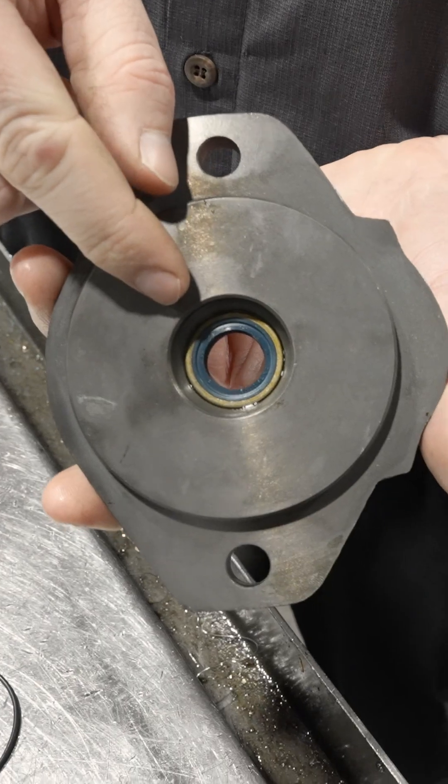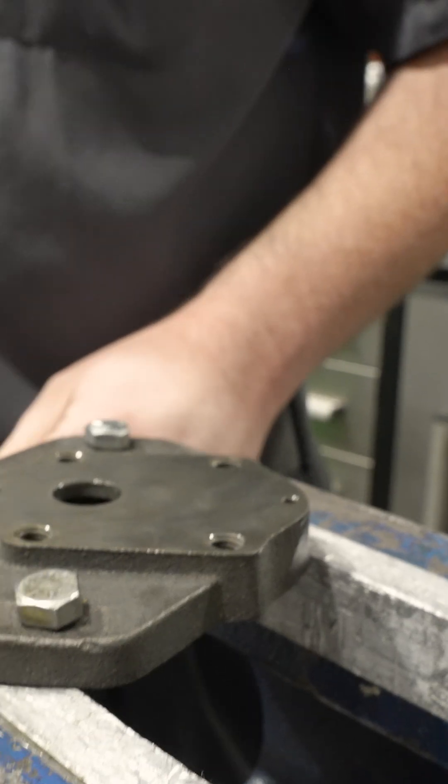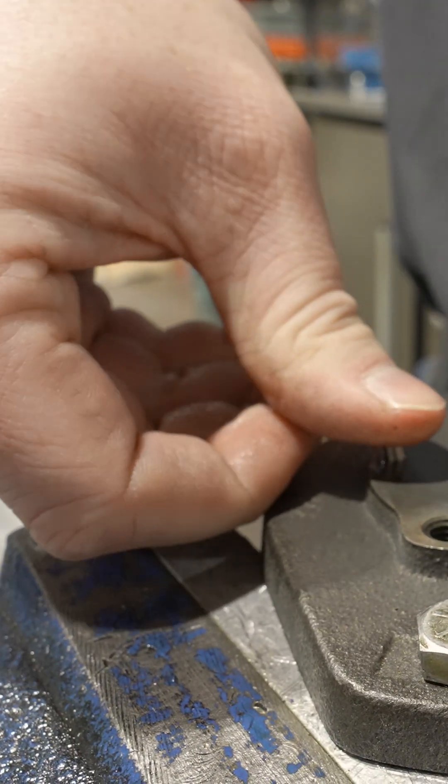PGP 505. Make sure all the parts are clean. Press in the shaft seal. Take note of what rotation of the unit is. Just a little bit of hydraulic oil — I like everything to be well lubricated in any gear pump I make.